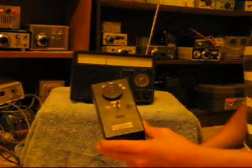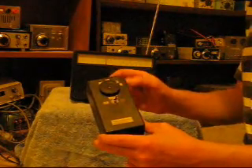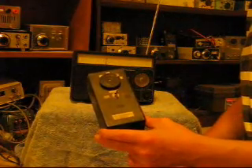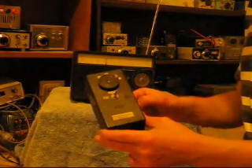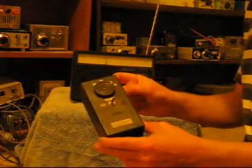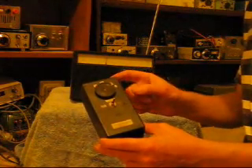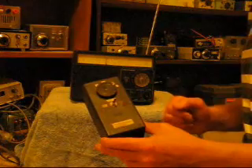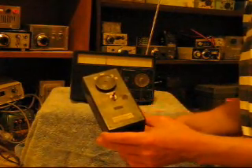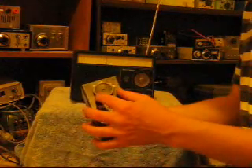I'm using a ceramic resonator oscillator, as it's easy to build something that's stable enough for this purpose in just a one-transistor circuit. But if you're good at building VFOs and don't mind a bit of extra complexity — say a few buffer stages and some better shielding — then the VFO will be a bit more versatile and you can cover the whole band. Or if you've got a signal generator on the bench that doesn't get much use, you can just use that. You don't need to build a separate oscillator.